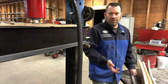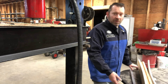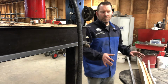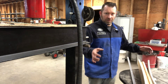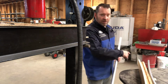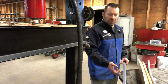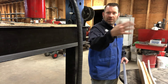I don't know, it depends on what you're doing, but say 6 inches aside. But don't cut it the same distance as what you're trying to bend. It won't work for you. And also sometimes the distance if you went across versus on the curve is obviously different. So your distances always change when you're curving something. Your inside gets smaller, your outside gets longer.